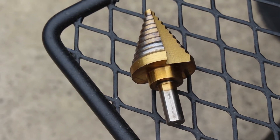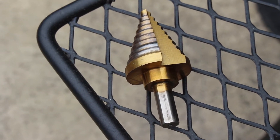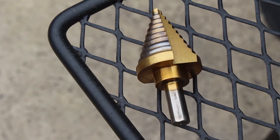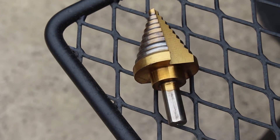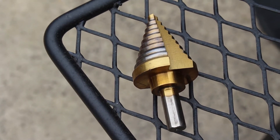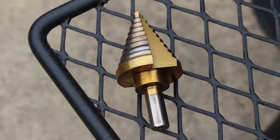If you're doing it like I did with an electric hand drill, I would suggest a corded one because you're going to burn through batteries if it's cordless. Take your time, run it on slow speeds, and use lubricant for drilling. If you push and force, you can actually burn the bit — I burned one and wore it down and wasn't able to get through, and had to purchase a second one.